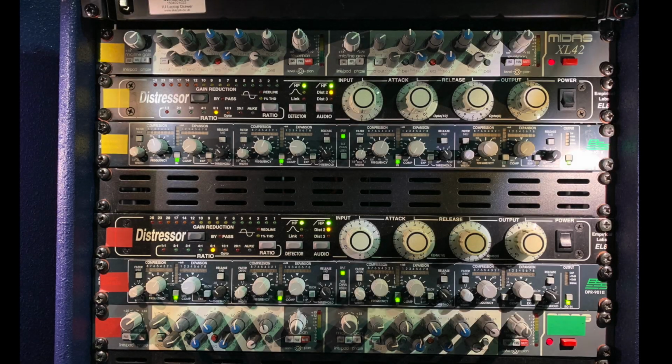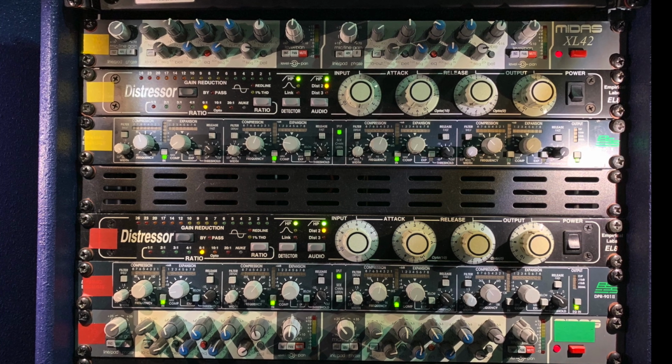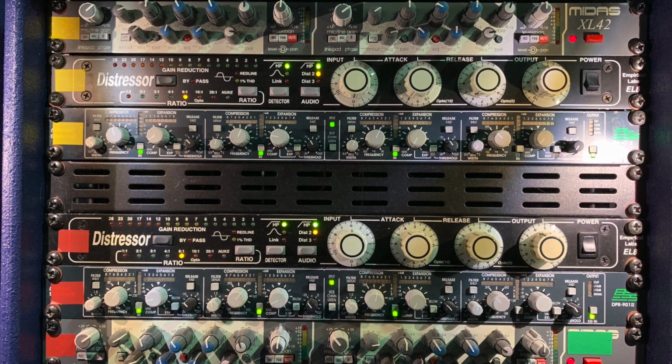Obviously behind the PA is a lot easier to deal with. If you imagine the yellow is behind and red is in front. Got it. What's quite the difference between the yellow and the red is that the red will have a channel of Dolby EQ specifically for it. So I can do super fine, tiny notches out that I need so that if he's 30 meters in front of the PA, pointing the mic at the PA, it's going to be all good. So it allowed me to focus in different ways depending on where that microphone is going to go.